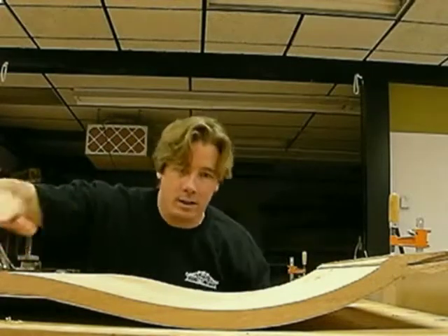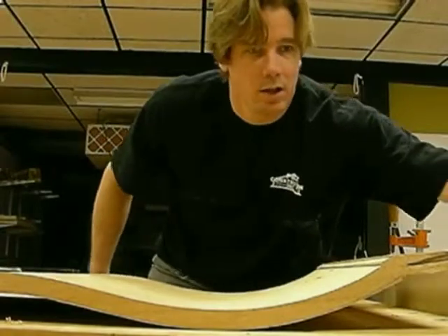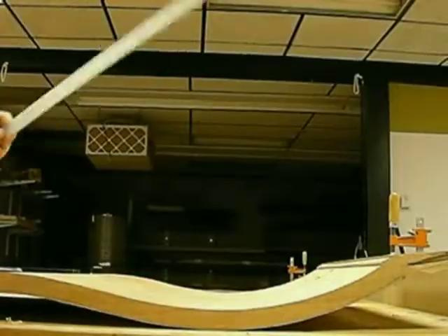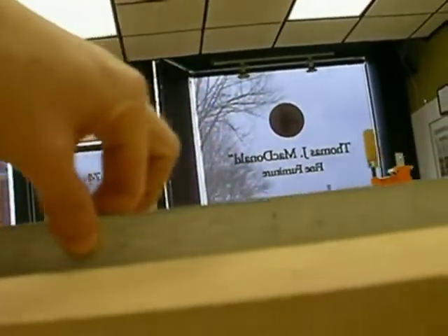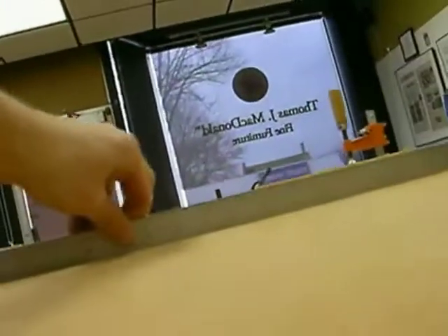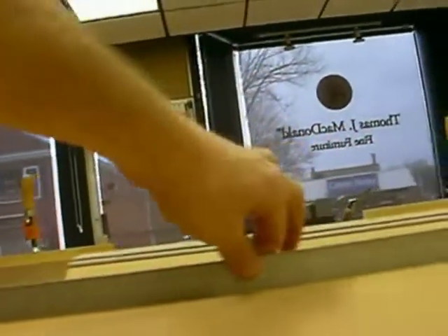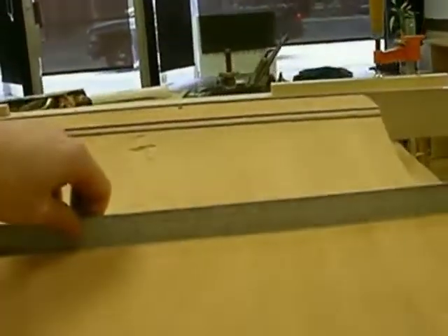I've already done this side and it came out really nice — I was surprised. I'm going to show you what it straight is, so I'm going to move the camera. This is the important stuff right here. This is how I do it — I put the straight edge on there and just slide it to make sure it's staying flat. And then I slide it down here. Make sure that it's flat the whole way. This is really important, guys, because if this gets screwed up when I go to fit my drawers, they're going to be a mess.